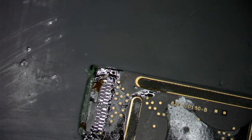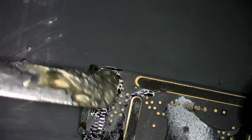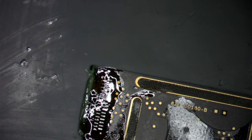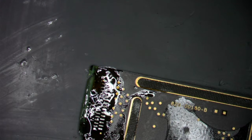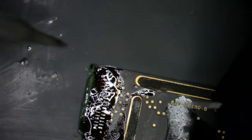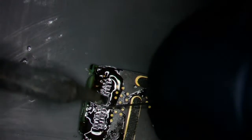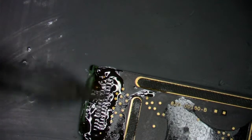I'm going to come back here again with some flux and slot that again. This time we're going to use our 183° solder because I love my 183. We're going to flip that and get rid of that factory solder. There we go, and we're going to wipe that to make sure it's all out of there.